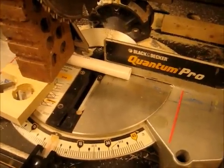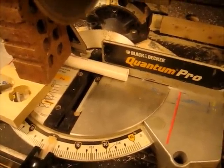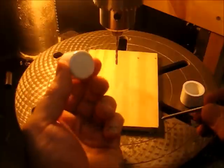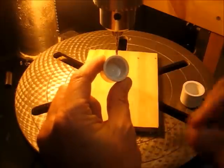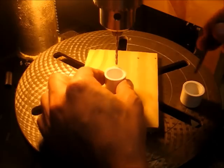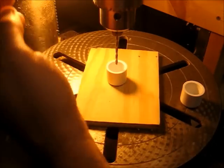Next, cut two pieces of pipe that are about 2½ inches long. If you notice right down inside the cap, there's a tiny little divot. You want to get a drill bit that's slightly smaller than your nail and drill right into that divot.